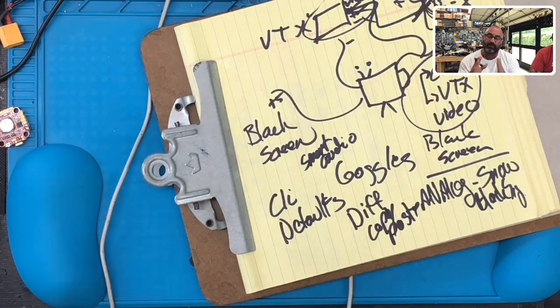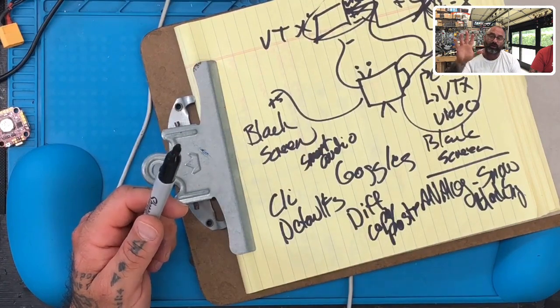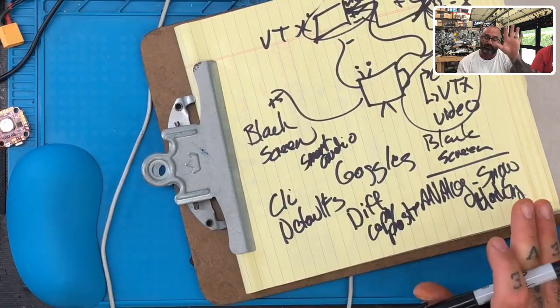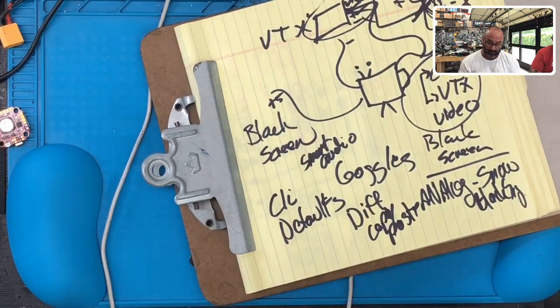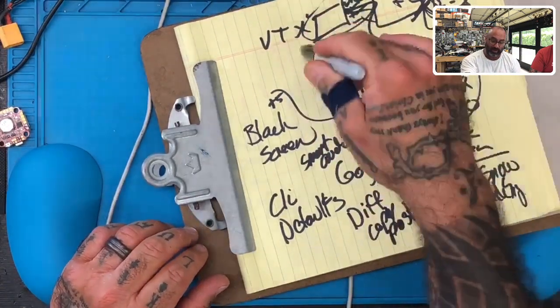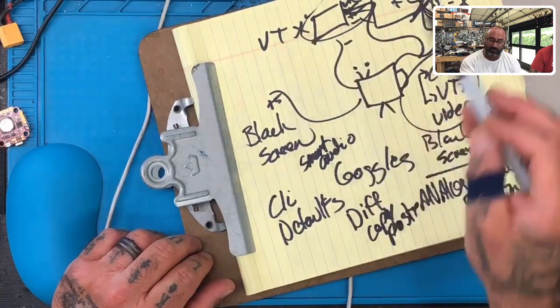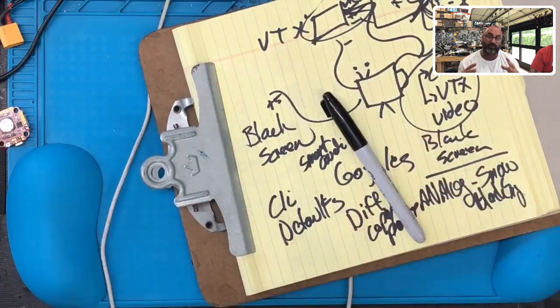So in either case: to test if your camera and VTX are working, eliminate the flight controller and attach them directly to each other with the video cable. If you want to test if the flight controller output is working, activate Smart Audio when you see a black screen and see if the Smart Audio screen comes up. If that works, it's going to be your video input. If nothing works, try a new VTX first or a new camera. One of these three methods is going to figure out which component is bad.